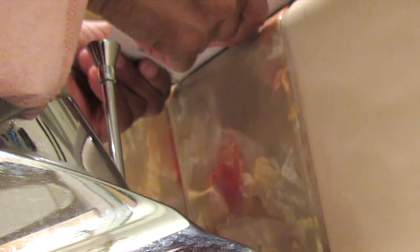Notice the more heat you put around the edge, it causes the contact to contour around the edge of the tile, which gives it the illusion of a replaced tile rather than contact covering it. And then you just keep rubbing till you feel like you have a real good bond. No air pockets. You can hear them when you have them. It pops while you're rubbing it. All right, that's good enough for now. At least you see what I mean. See how well that's in there?